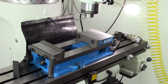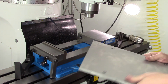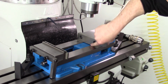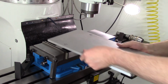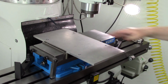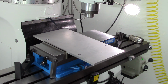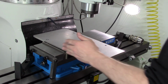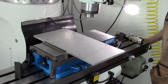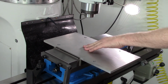Okay, the only tricky bit, I guess, it's not going to be too tricky. We'll stick this in the parallels. Wayward chip. We'll stick this guy in here, and I'll screw the chassis to it. And since we squared it to this edge, when I mark the holes, we'll just consider this true, and then we're going to go along here and drill our holes. I think that'll be the right way to go. So let me bolt the chassis to this, and I'll be right back.